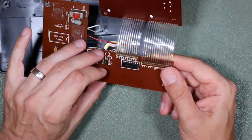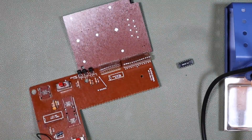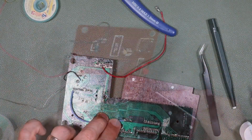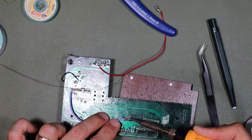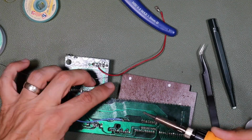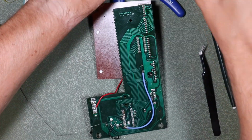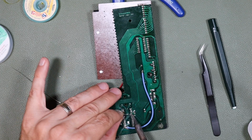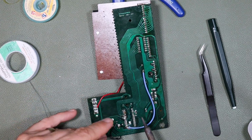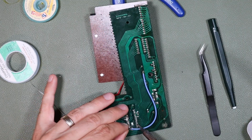So I removed the second chip, I'm assuming it's some kind of multiplexer or driver for the LED display, and I installed it into the original board that had been plugged. I also had to install the microprocessor that I'd originally removed from the functioning board back into the plugged board because I'd removed it from that board when I was trying to determine what the connectivity of the various components was. However, when I removed the processor for the second time, I'd further damaged one of the pads, so I had to install a wire link between one of the pads on the microprocessor and the LED driver.